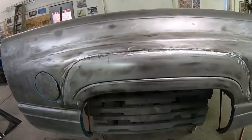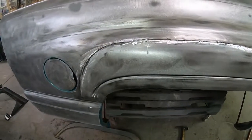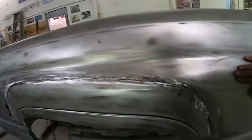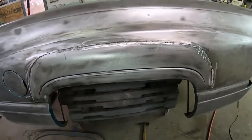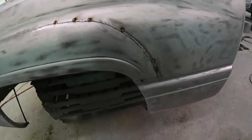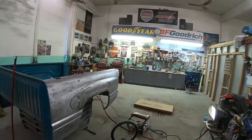So there she is all welded in. When you get to that point where you're grinding your welds down, you don't have to take them completely off. I like to make sure there's still a little bit there for strength. We're going to be coating it with body filler from this point anyway. I kept the heat down so there's no warpage, so it's not going to take much filler at all. The next thing I'll do is go around and check for anything that looks like there could be a little porosity or pinholes and touch them up with the welder. From there we'll move on to some body filler, but I'm not going to videotape that part - I've done videos on that kind of stuff before.